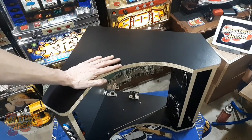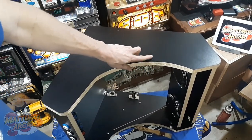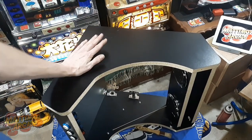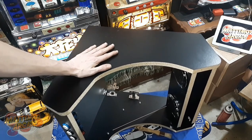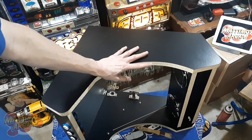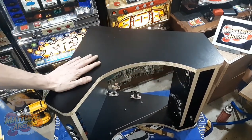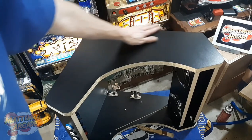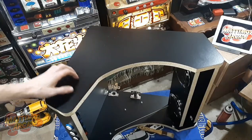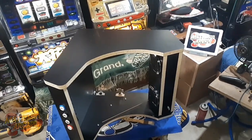To remind you — when we did the control panel, mistakes were made. With this wood being cut the way it is, it leaves kind of a little edge on it. When I wet the control panel down so I could move the art around and get it in a perfect spot without bubbles before we sealed it, I had a problem — we couldn't get the moisture off the edge when we squeegeed it out. So this time, ahead of time, I've gone around with the sanding block and just knocked that edge off so we don't have that problem.